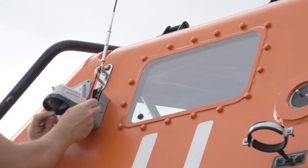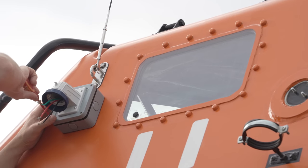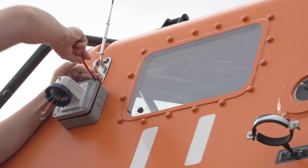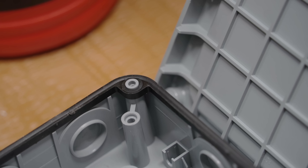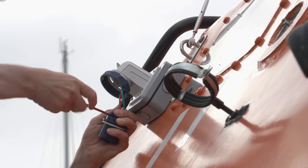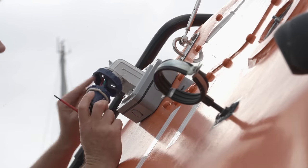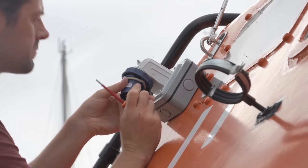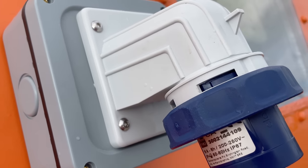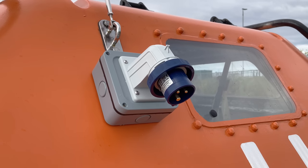I have a downward facing plug attached with a rainproof gasket. This plug component is IP67 sealed, although I have no overwhelming desire to fully submerge it at present. I pre-attached the angled plug into the box's lid and added sealant around the four bolt heads, as the gasket only runs around the edge. Then I ran the other four bolts through the shell and into the corresponding internal socket. The wires are screwed into the terminals tightly and the final spinny part of the plug clicks reassuringly back into place. I've ordered a little cap to fit over the plug to keep out the salt air and to stop anyone taking up residence in the nook or cranny.